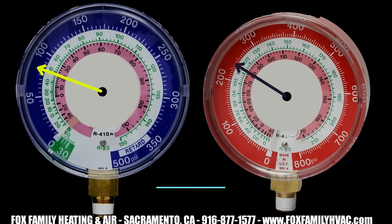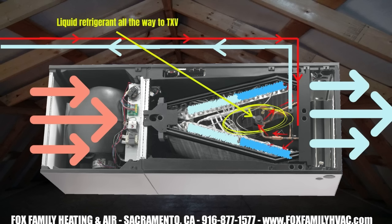Here we see that the evaporator coil is about 20 degrees. For proper refrigerant levels, the image I want you to project in your mind is this: our end goal is to have liquid refrigerant reach all the way to the TXV at the evaporator coil to meter the refrigerant appropriately. Right now, there is not enough liquid in the system to do that. This means vapor is making its way to the metering device and we are not giving the coil enough refrigerant to interact with the speed of the blower air moving across it. We need the perfect balance of airflow and refrigerant pressures to create that 18-22 degree temperature split. Let's suppose the system holds 10 pounds of R410A — I'm thinking the system is about halfway charged from what we've seen so far. It's an approximation, but we have to let the customer know about how many pounds we want to add so they can give you the okay to move forward.